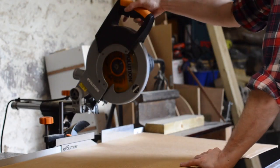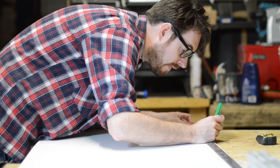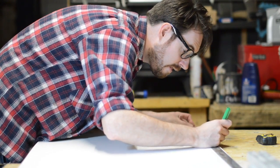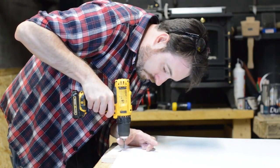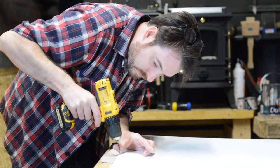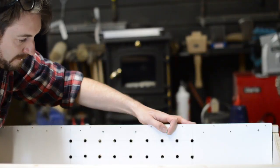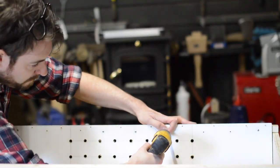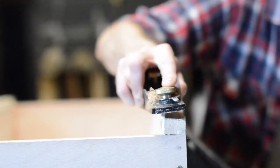After doing some research I realised what mistake I'd made with the perspex — if I wanted large holes in it I really needed to start with a small hole and move up every size. Anyway, I decided not to go and buy more perspex and I'd just use a bit of 3mm thick hardboard instead. So I marked out and drilled the holes again. I also decided to put fewer holes in this time, as with the hardboard I thought it'd be easier to add more holes afterwards while it was in place. It could now be bent and secured in exactly the same way as before, and this was much easier to get into place than the perspex.